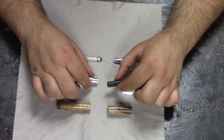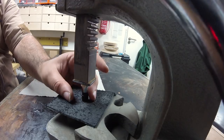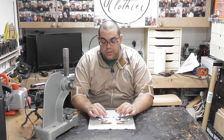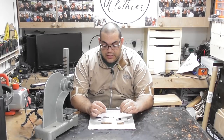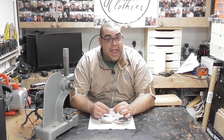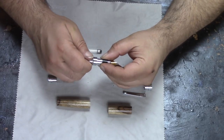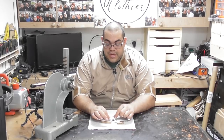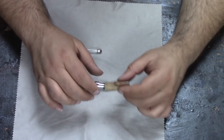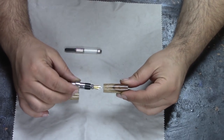For the first part of assembly, take these two pieces and they just press together. Because I'm concerned with grain orientation, I'm going to assemble all the metalwork that's going to be at the joining section before attaching anything to the wood. The first thing is attaching the nib, making sure everything is nicely tight but without making it over tight. Now I'm going to screw these two sections together. Now I can start to attach the wood — because it's in its closed state, I know wherever I put these they will always be in that orientation when closed. Start with the cap.